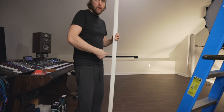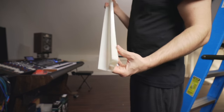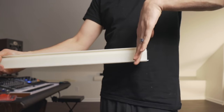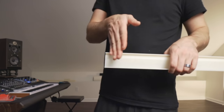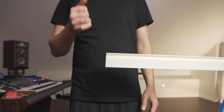So I'm starting the edge track, which is going to go on the border around the whole section here. It's a square edge, looks like this. The way that I'm going to install it this time is I'm going to cut at a 45-degree angle this way, and then on the bottom piece I'll also cut at a 45-degree angle so that the two pieces meet up nicely when you go to tuck the fabric in. Same thing when you go across to the midsection — I cut at a 45-degree angle, and the midsection piece will have two 45-degree cuts on it so that the two bottom pieces and the center piece can line up just perfectly so that the fabric seam looks seamless.